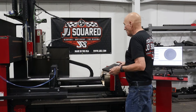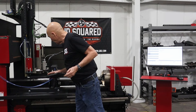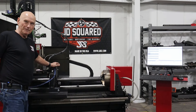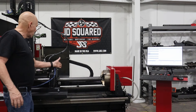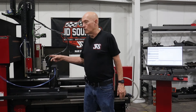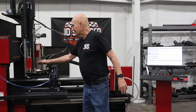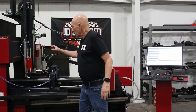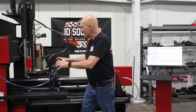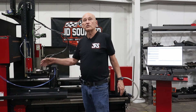What we need to do to run that is bring the torch over to approximately the middle of the tube — doesn't have to be perfect, eyeballing is more than good enough. Notice when I dropped it down, I did not hit the stabilizer. Whenever you put a stabilizer into the machine, you want it as close to the torch as you can possibly get it without actually hitting. Now this particular XR-12 is equipped with the BLE attachment, which is basically a tilt head — this is how we cut angle iron structural. If your machine doesn't have the BLE, the torch is much further back, which means you can move the stabilizer closer to the torch that way. You always want the stabilizer as close as you can to the torch without actually hitting the torch.